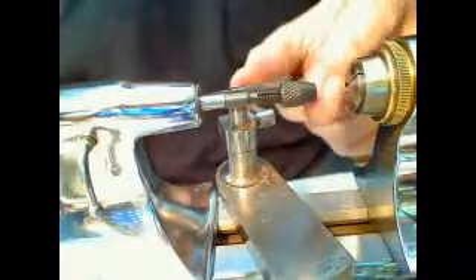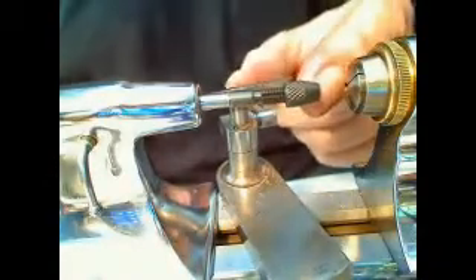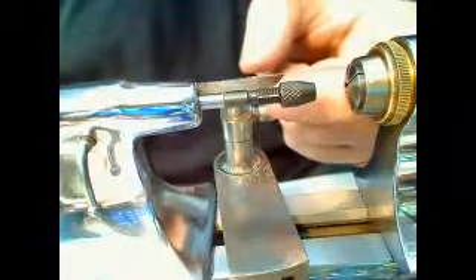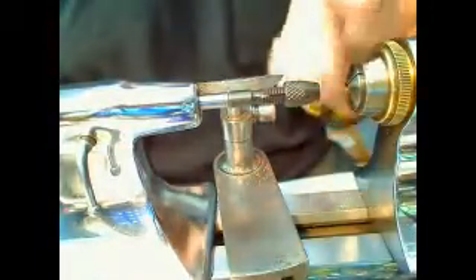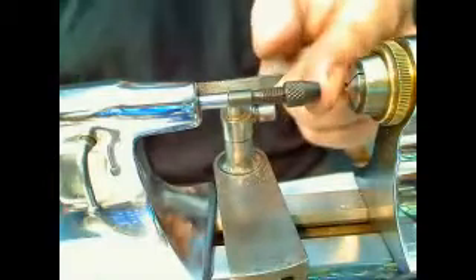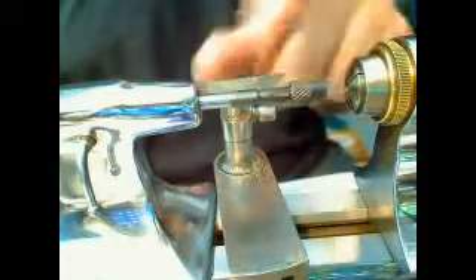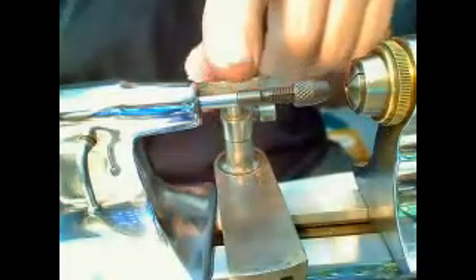Now for friction. My nephew asked me — Zio, which is Italian for uncle — how do you hold that from spinning? When I'm holding micro drill bits, there's not a lot of force on those. They're carbide drill bits to drill the end of a shaft — I'm drilling holes for a pivot for a watch gear, looking at 0.08, 0.07, 0.09 millimeter size. So it doesn't take much force. All you do is take a piece of tape — like masking tape — and put the tape on the end between this metal and the chuck, and this will hold it in place.